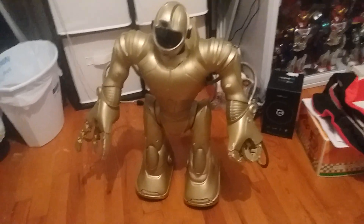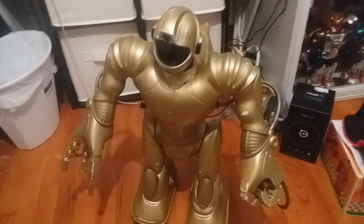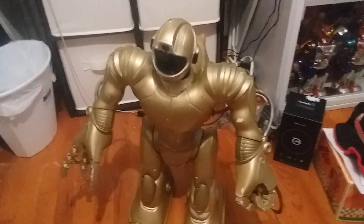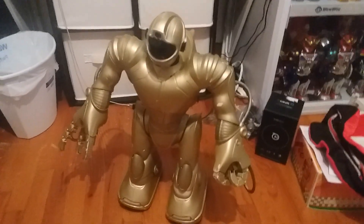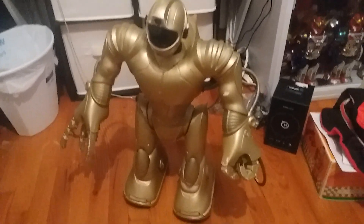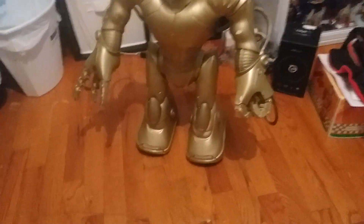There was a lot that had to be done — of course the rewiring. I did reuse the original wires that were in here; I just resoldered them and adjusted them so they look a lot better. I also had to re-glue a lot of portions, especially the chest area. As you can see it's fixed around the back. The head needed a lot of new parts from the inside. I also redid these parts — as you can see, one of them is no longer upside down, though they're still not matching ones. I have spares but they're black, so I just left the originals on there.